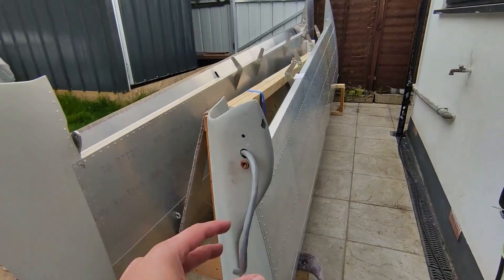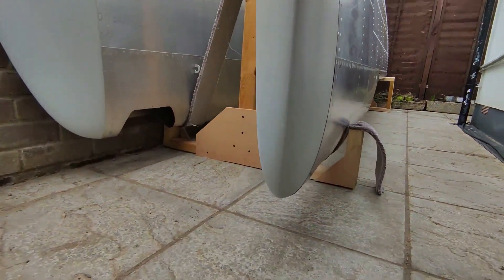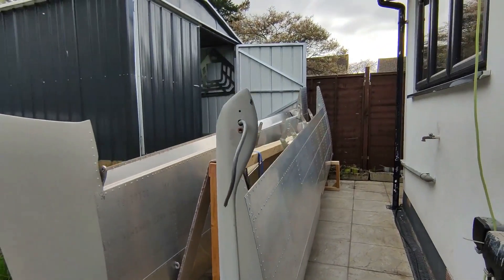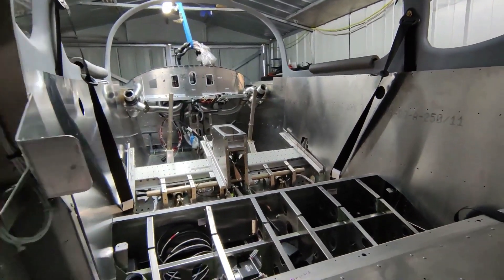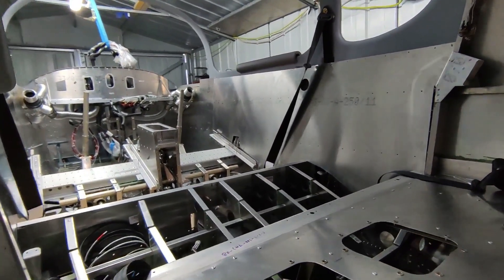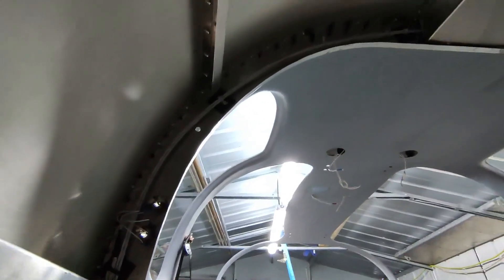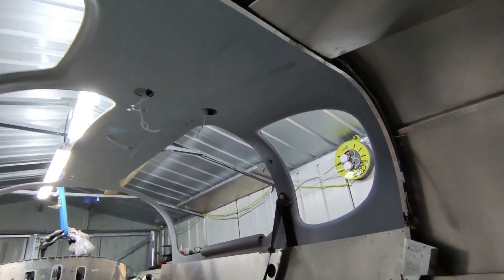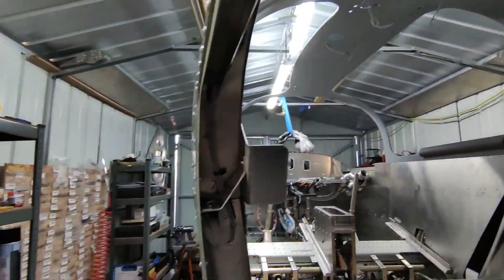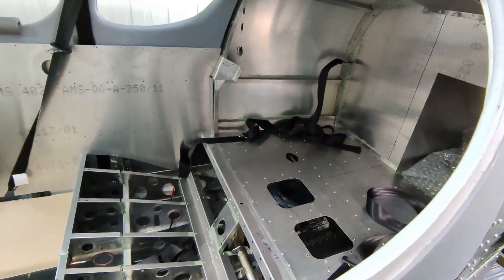With lockdown lifting, Nick helped out and we had good weather — both wings came together really well. There's no gap anywhere between the fiberglass tip and the wing skin, so it came out quite good. The wires for the wingtip lights were also run through, and then it was time to work on the harness — threading it through from the front all the way to the back. The headphone jacks for the rear passengers were the last connections at the very end, and those were the first items to be properly secured and installed.